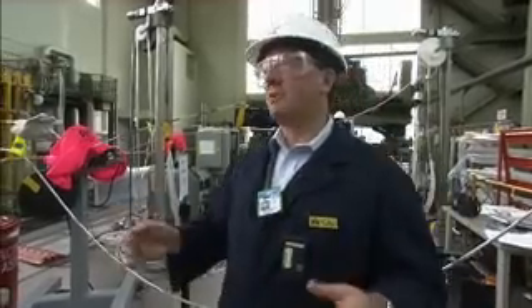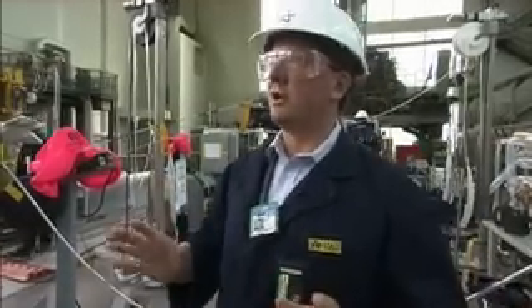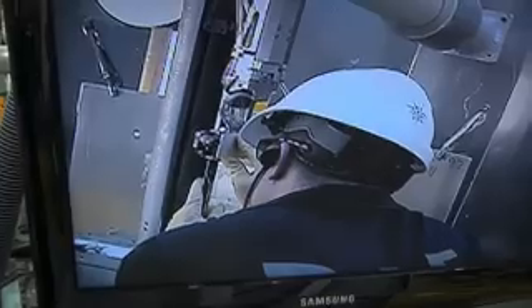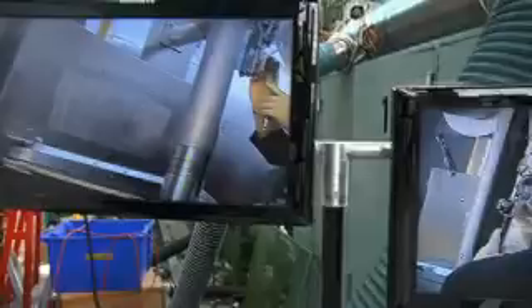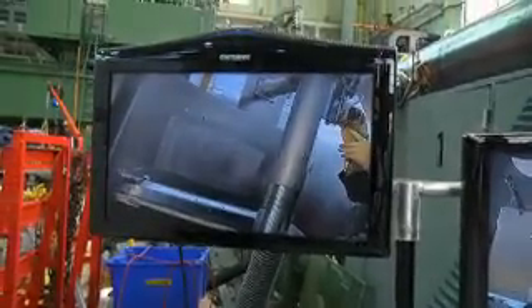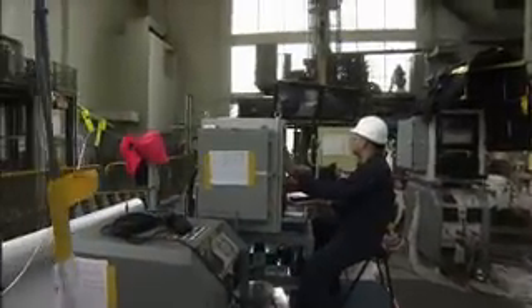This last site combines all of those factors together. Last week we went in the vessel with all of the weld tools in a dry run. We ran the tools over the repair site, mocking up all the operations we need to conduct to make sure that the physical geometry of the vessel is exactly as we've got it represented in the 3D models for all the tooling operations. We've been very careful in how we're approaching this because we know we have one chance to get it right.